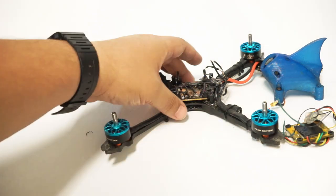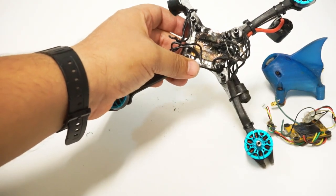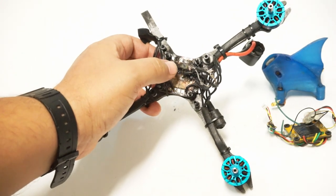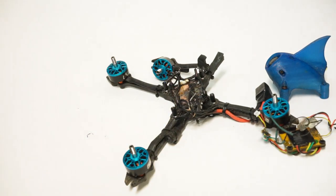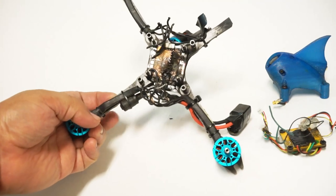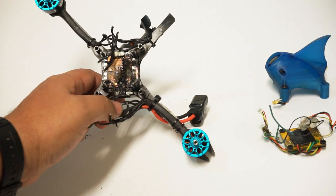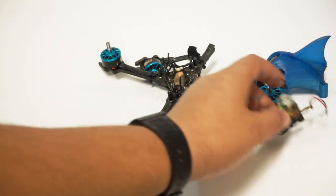With the 5141s, I was definitely pushing it way past where I was getting low voltage warnings. So I may have just heated this entire ESC up to the point where a solder joint came loose. I may have heated this copper tape — it's very, very thin — up enough to the point where some of it just dripped onto one of these FETs and made a short. Or in that crash, I may have knocked one of these power leads off. Once those things melted loose, they were probably just shorting like crazy, and that's the source of the flames, which then burned up the flight controller.